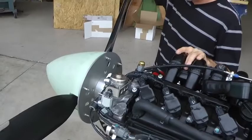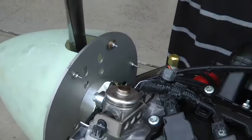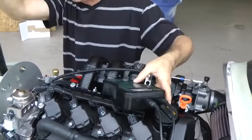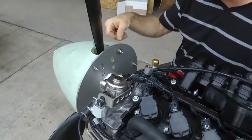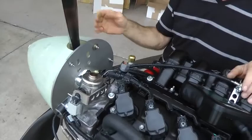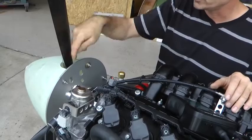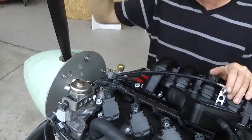It wasn't very hard to balance it. We put two big washers on one of the studs, moved it around, and wrote down the IPS readings we got from the instrument showing the imbalance. Once we found the lowest point — .27 — we played around with more or less washers at that same location and found that for some reason we were already very accurate with how we started out. We couldn't make it any better. We tried adding a tiny bit of extra weight one bolt over each way, and found it to be slightly better putting one here.